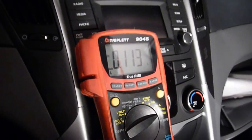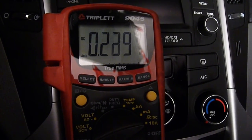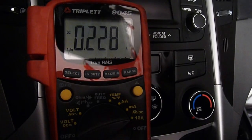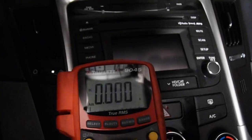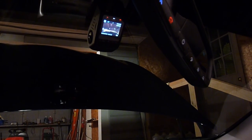Now we're going to turn it on again. Watch the total current draw with the camera, the relay module, and the button — all devices that can be powered up on this system. It never even makes 300 milliamps. Okay, this is the key-switched power. I'll be doing a current draw test with the key-switched power. The timer module and the button aren't involved in this test at all. The camera's off right now — I'm going to turn on the key. Camera light is on and starting to boot up. Alright, it's fully booted up now. Current draw never even makes it to 200 milliamps.